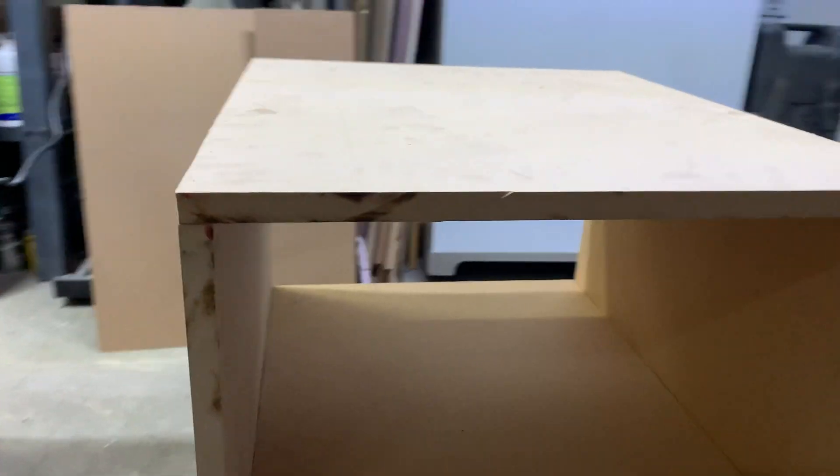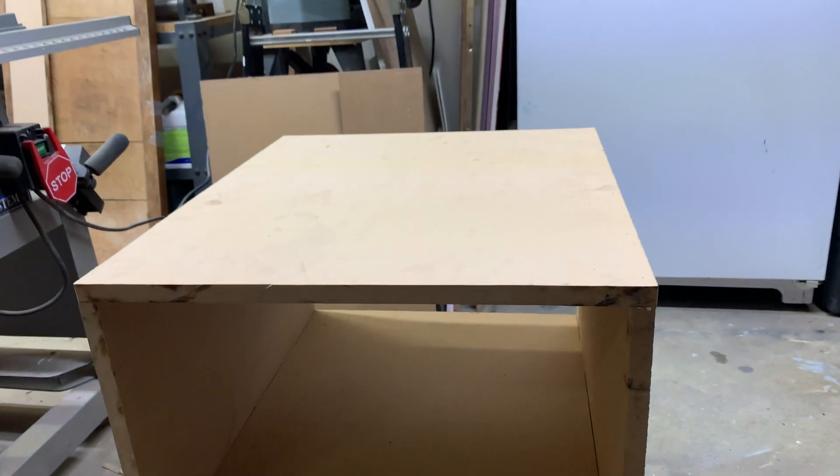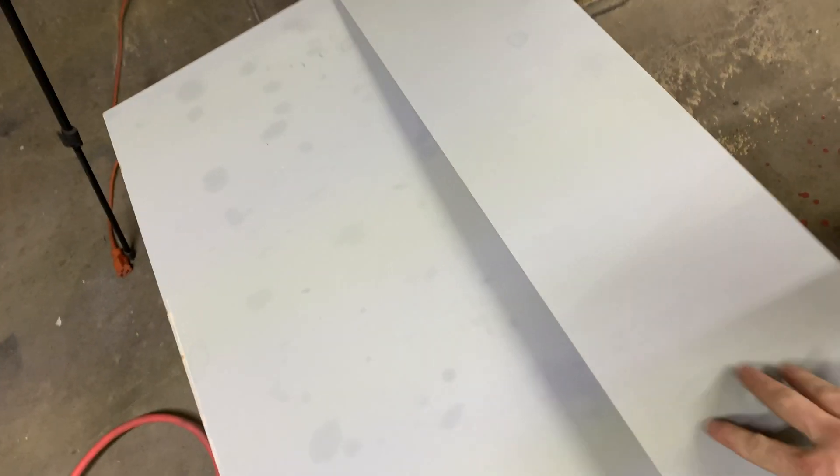So this is the desktop and I've got some shelves — this will nicely fill up that corner. It's not the nicest looking thing, but I'm going to sand it and hit it with some paint because MDF is not the most interesting wood. I've sanded it enough that it'll hold paint nicely. I've got this thin stuff and I'm just going to nail it to the back — I'm not even going to bother gluing it because I'm feeling lazy and want to get this done. I'll try cutting the pieces to size after the fact.